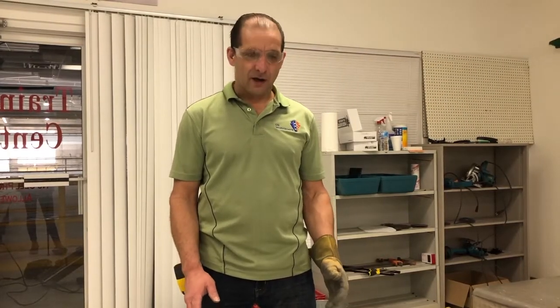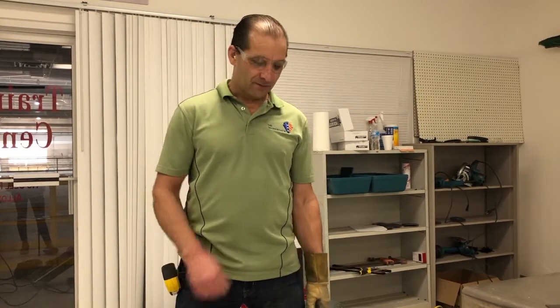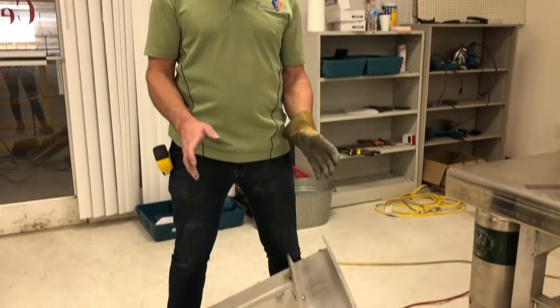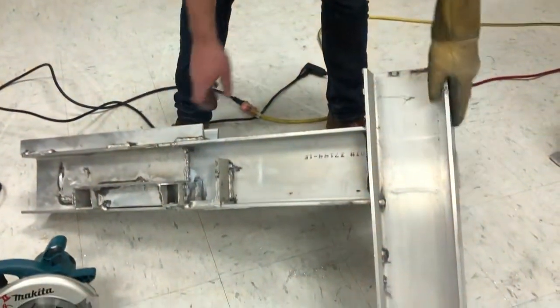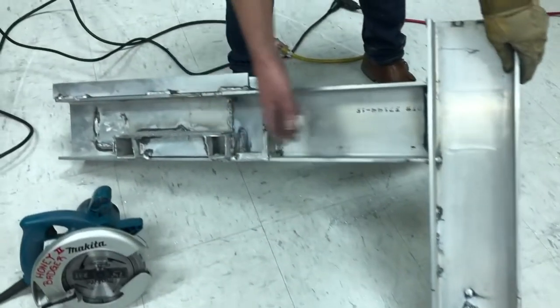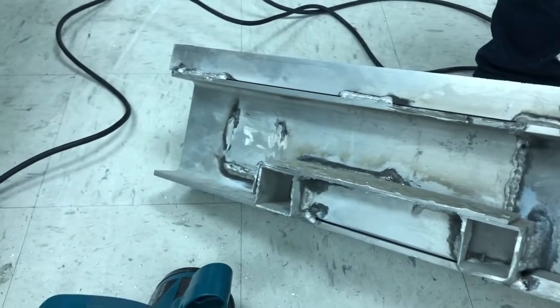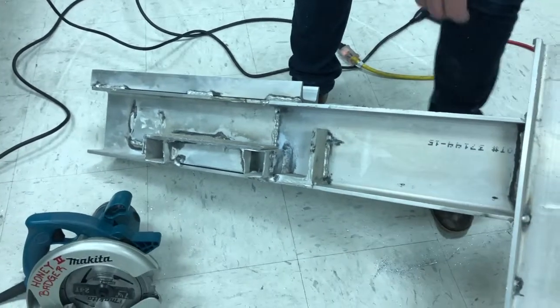What we're going to do here is take a really ugly piece and cut it apart using two tools — the circular saw and the sawzall — together in unison. This thing is a disaster. It's got all kinds of scabs welded all over it; there's nothing good about this piece. But we're going to demonstrate cutting in some hard spots because that's what we'd like that sawzall for.